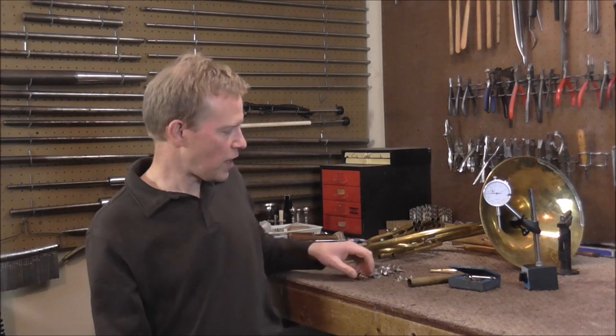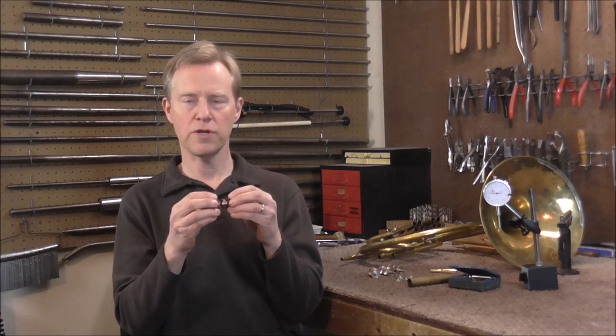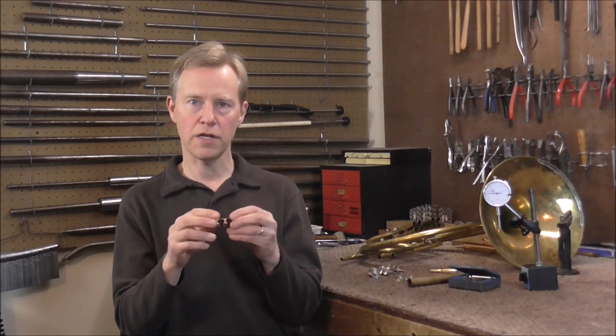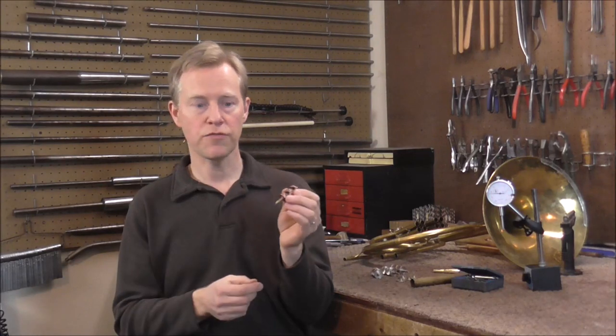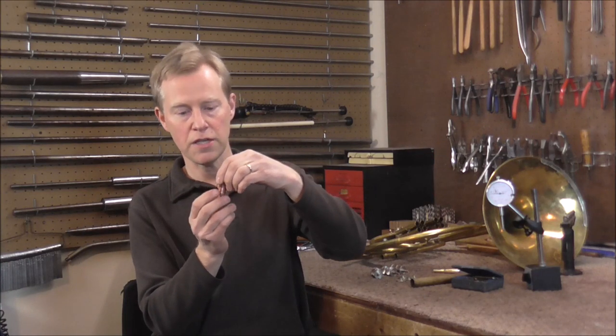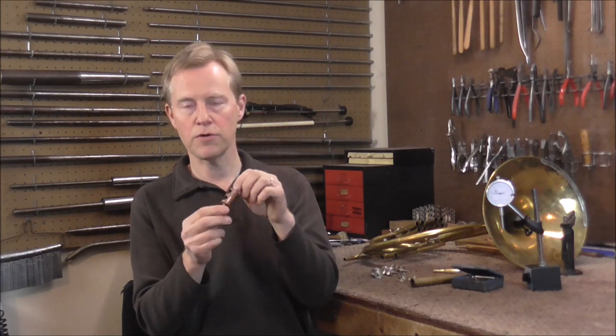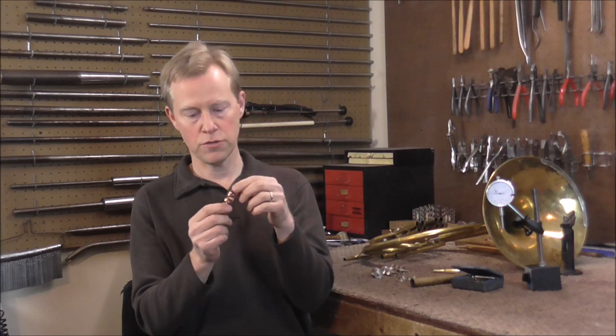You cannot cut the face of a valve when the valve is wobbling around. You also need a lathe with a very tight tailstock and a tight carriage so that things don't move around when you are working. My lathe is not tight, so if I were to chuck a valve in, take it out, and put it back in, it would line up differently the next time and cut differently. Also, for rotors, the two spindles need to be exactly on center with the face of the valve — if they are not on center and the valve rotates lopsided, it will go back and forth inside the casing, making the rotor not work well. The two spindles and the face of the rotor need to be exact.